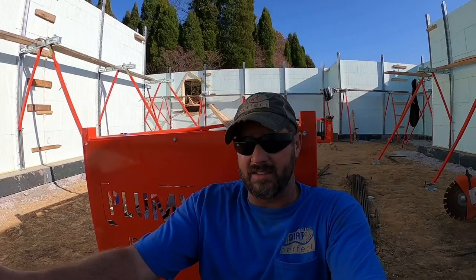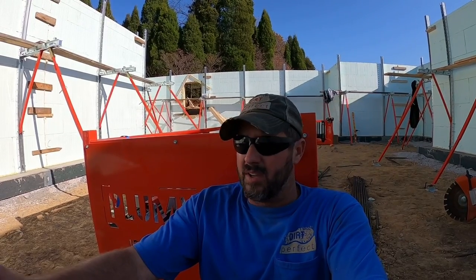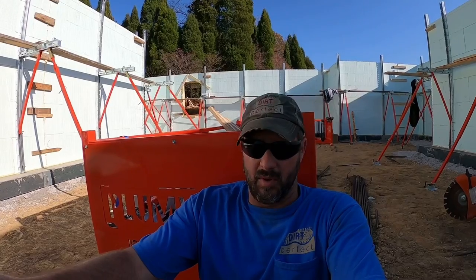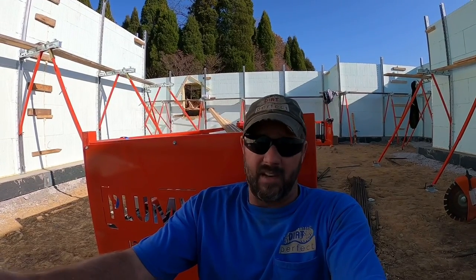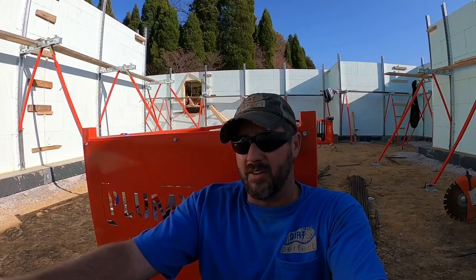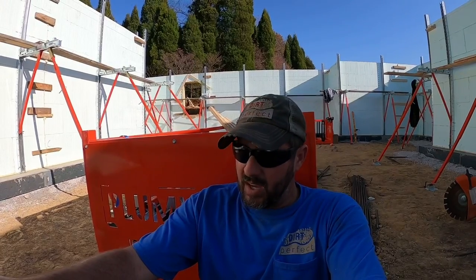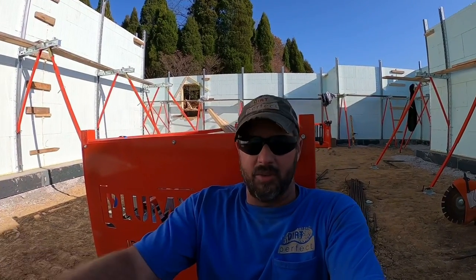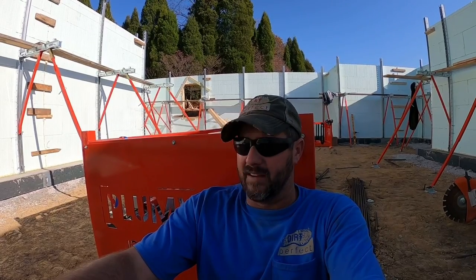Having the proper bracing on an ICF job minimizes labor and improves the quality of the pour tremendously. It can be done without. I 100% do not advise doing without. I have poured one time without bracing, and I have been back to fix multiple jobs that were poured without bracing. I'll never do it again.